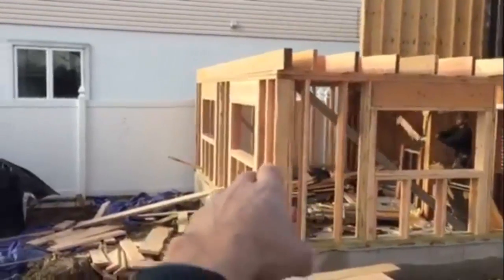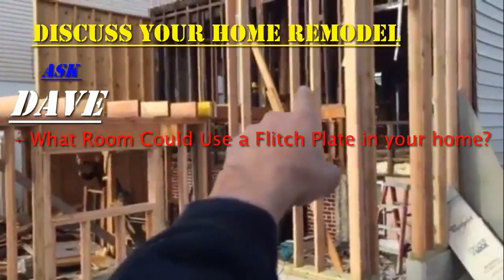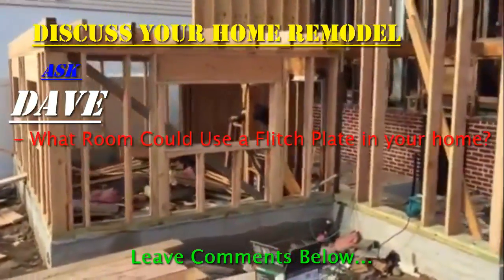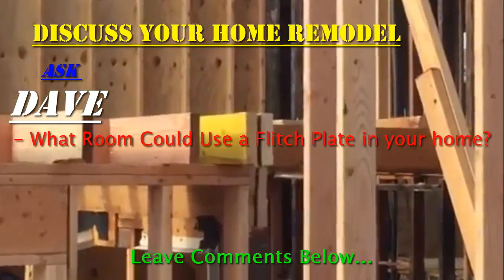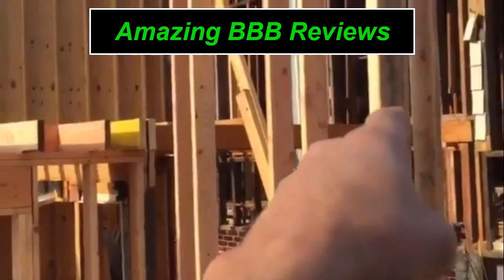On the lower level you can see we put in awning windows — two in the rear, one on the side, and another awning window going into the side entry. Now we're taking out the center wall between the addition and the existing structure. You can see our flitch plate — I'll zoom in on that yellow-colored beam right there. That beam is two pieces of 1¾ inch by 7-inch LVL material with a ¾-inch by 7-inch steel beam, all put together. I'll show you how we structurally connect the existing ceiling to the new beam.